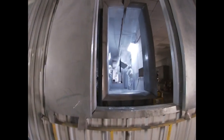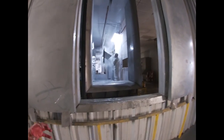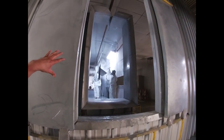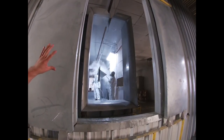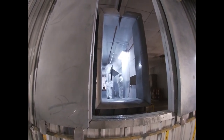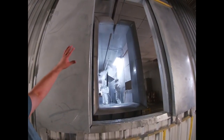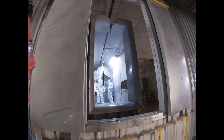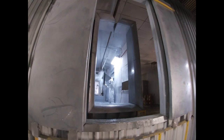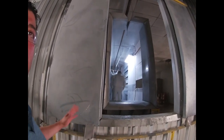So this isn't regular paint — it's not wet paint. It's actual powder. You can see the guns right now. The powder sticks to the metal, and it does that based on electricity — electrostatic. So we have to ground everything. The guns make it stick. If you touch the cable you won't get shocked — it's just grounding. The gun doesn't work without that ground.